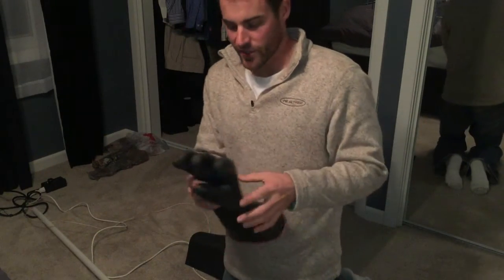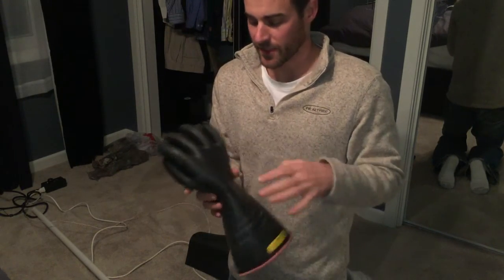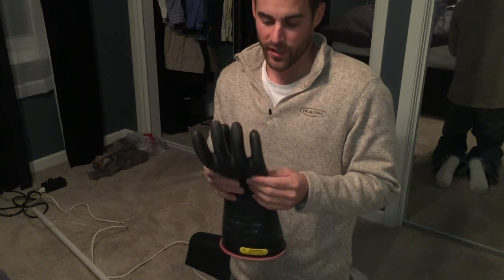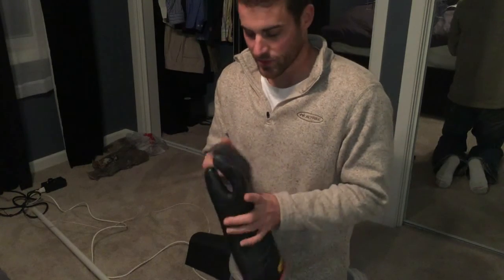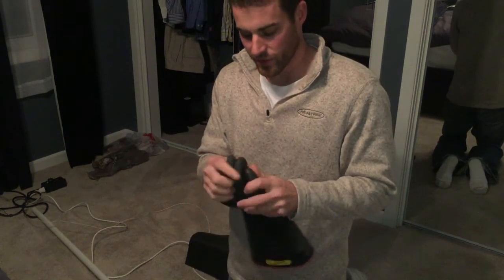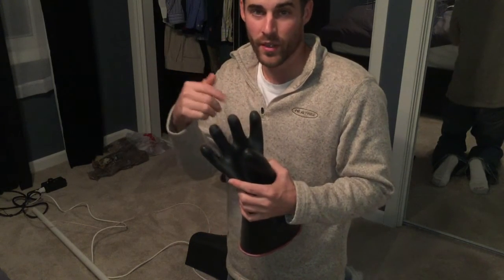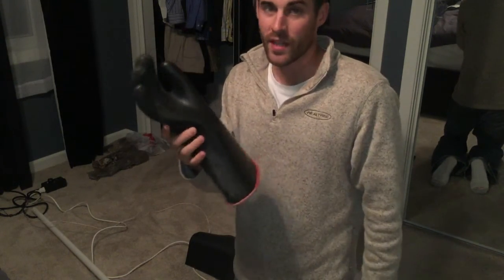The whole reason I got these gloves is that they can protect you from getting shocked when working with high voltage. However, if there's even a slight pinhole in these gloves — I'm talking about from a needle, something you would never even see — you have to check these all the time for pinholes through a couple of different methods. They're red on the inside so you can see if there's a crack — when you stretch the black rubber, you can see it show through. But if you put a pinhole in this, it doesn't matter how small it is. The electricity will find its way through that hole. In this case, there's just too much voltage building up to demonstrate that because these gloves don't have any pinholes in them.